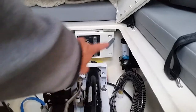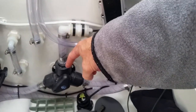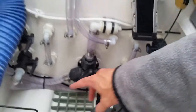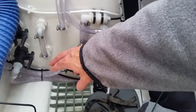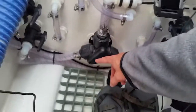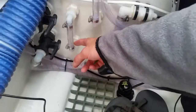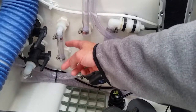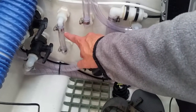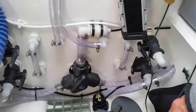From the tank position it goes out of these black lines through the hatches, comes out right here, and depending on what this switch is in, it gets diverted to either the port or starboard side. Right now I have it on the starboard side, so it runs through here up to the top where it dumps into the tank. The sight glass right here shows it's basically full. Here's the other side — it's a lot lower, so pretty soon I'm going to switch this to start filling that one up.